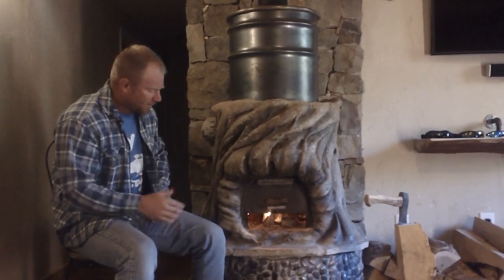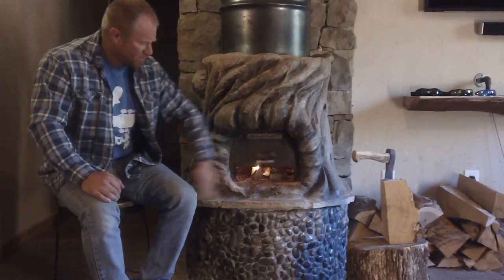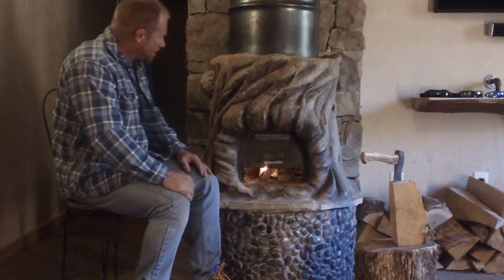It's built up 18 inches off the ground. I'll put a chopped-off limb on this side. So I call this a Stump Batch Rocket Stove — it's probably more accurate to call it a Stump Batch Mass Heater. There's about 900 pounds of clay, sand, and brick there — about a half a ton of mass. It's sitting up 16 inches on concrete blocks stacked and mortared together. I took a piece of metal, put a radius on the front, poured that with a couple bags, then put rocks on it, brought it up, and put about an inch-and-a-half rock layer on top of that.